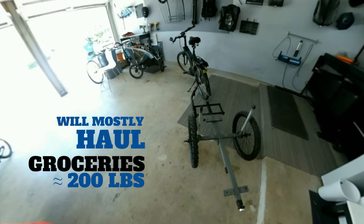I just need to figure out a way to lighten it up. If I wanted to mod this one, I'd probably try cutting the lower half of the frame off since I don't put that much weight on it anyway, and then get a lighter plastic tote bin or something smaller. One other shortcoming for single wheel trailers is you lose space by having the wheel at the center. I've seen some where if you want to use a large shopping bin, you could just cut out a slot where the wheel is and protect the wheel so things don't slide into it — that should be pretty easy to do.